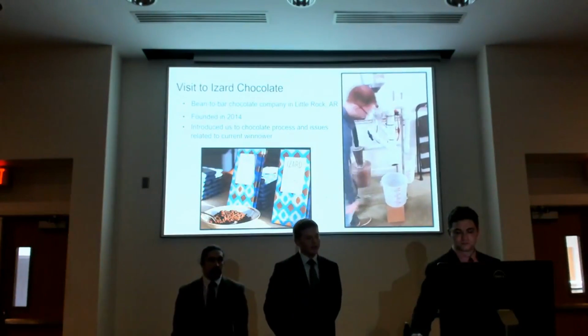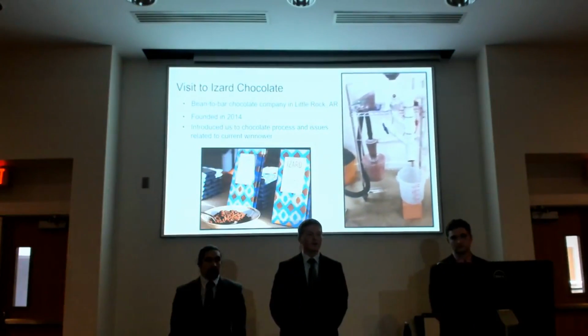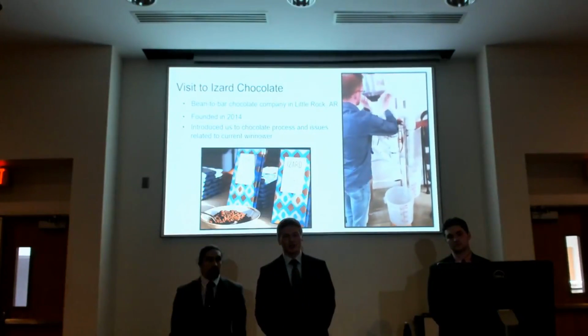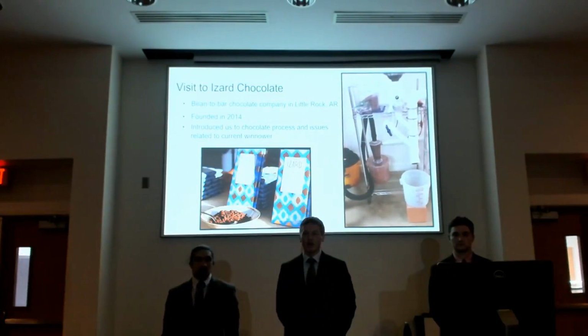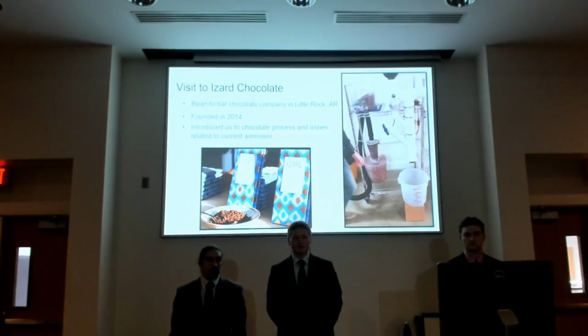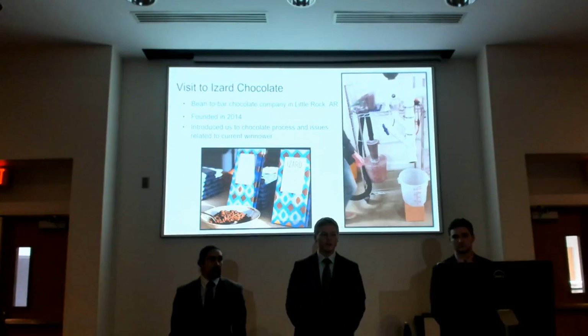He made it himself, and he uses a food processor to grind the cocoa beans, and this crushes them too far. He makes a lot of dust. He estimates that he loses about 25% of the viable nibs, and when cocoa beans are about $700 for 100 pounds, that's a lot of money if you're losing a quarter of it.